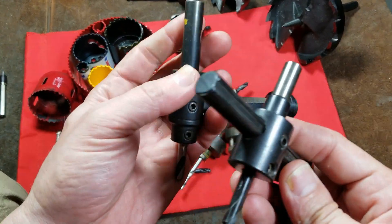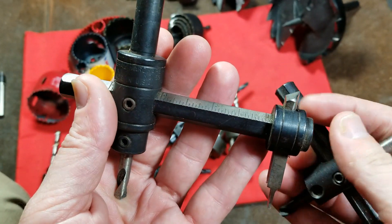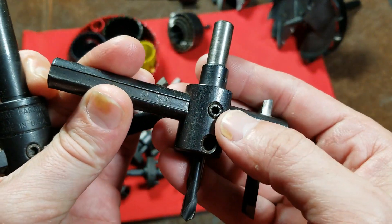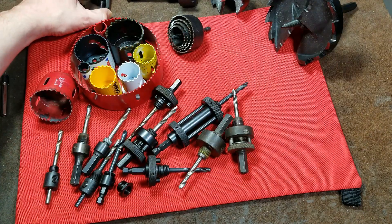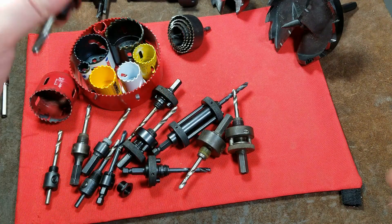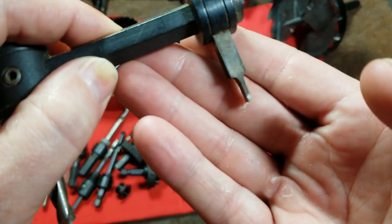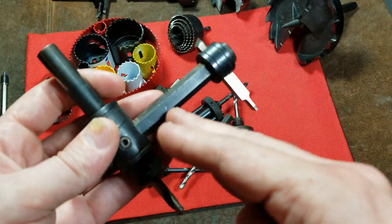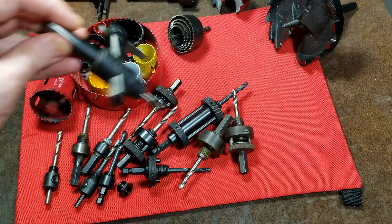The difference between the two fly cutters is the heavier duty version has thicker shanks, a thicker swing arm, markings for easier use, and a hex to prevent rotation. The smaller one relies mostly on the set screw. These are not very common because of their difficulty of use and the fact that you have to custom-grind a bit. Since they have an arm that sticks out, they are really unbalanced and want to wobble quite a bit.